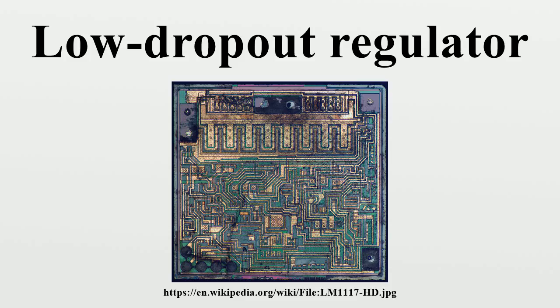It is also expected from an LDO to provide a quiet and stable output in all circumstances. Stability analysis puts in place some performance metrics to get such a behavior and involves placing poles and zeros appropriately. Most of the time, there is a dominant pole that arises at low frequencies, while other poles and zeros are pushed at high frequencies. Power supply rejection ratio (PSRR) refers to the LDO's ability to reject ripple it sees at its input. As part of its regulation, the error amplifier and band gap attenuate any spikes in the input voltage that deviate from the internal reference to which it is compared.